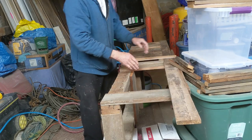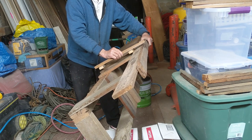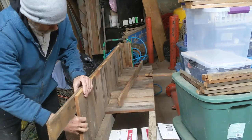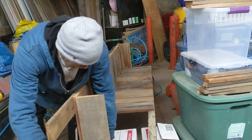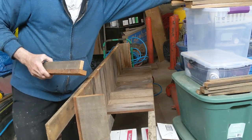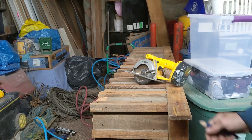I just turned this way so you guys can see. Once I have this jig in here and done that way, I just remove it like that and move to the next row. That is how we go, just keep going, flip it over again - that way it's a little bit easier to work. Let's do the square part here. I just try to keep everything nice and square, and when I'm doing the corner I'm just gonna use a couple pieces like that - it would be something just like that. Then I just come in here and nail it on.